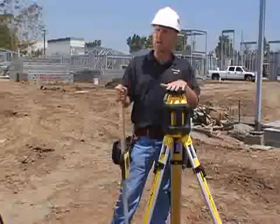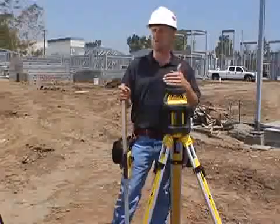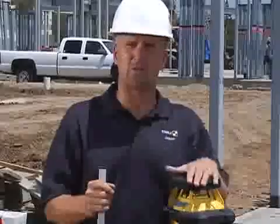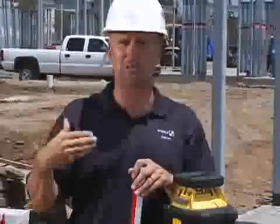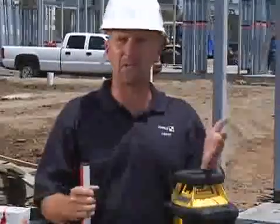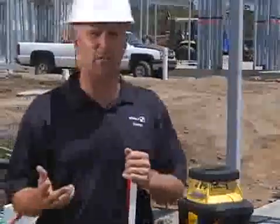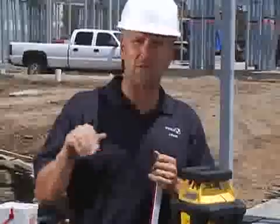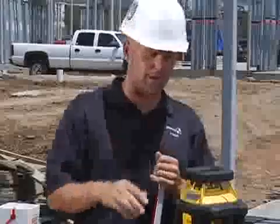So now that we're outside on a job site, I wanted to quickly show you an example of how the simple slope works. Now keep in mind this is an example because on these kind of job sites that you're doing slope, it's typically over a great distance. I'm going to show you quickly over a short distance how we would lay out the laser to use simple slope. So the first thing that we would do is we're going to turn the laser on. I know it sounds simple, but we got to turn it on, and we need to let the laser go in level because we need a benchmark to be able to measure from in order to get slope.